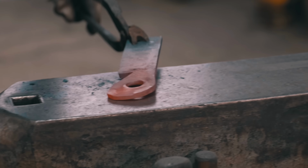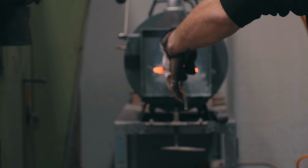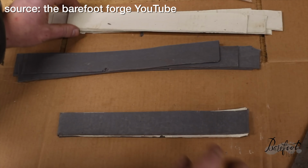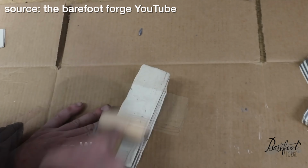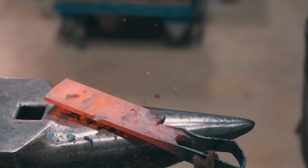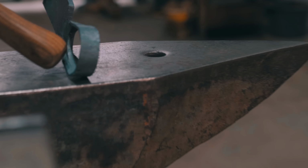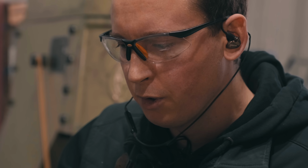Forging, for one, you have to understand the mechanics behind it, how the steel moves. You have to understand the volume, but also it's quite interesting. You can simulate that with Play-Doh, actually, and it's interesting with Play-Doh. You can use your hands and you can touch the stuff. With forging, it's more complicated. You don't have a lot of time. You have to hold it with tools, so you have to use tongs, and you can only manipulate it with a flat surface. That is your anvil and your hammer. So that makes forging so interesting, because you have a lot of limitations that you have to overcome with, essentially, technique and thought you put into it in advance, to compensate for the complications of only being able to use tools.